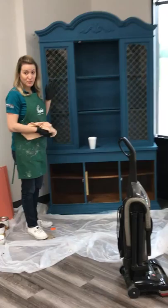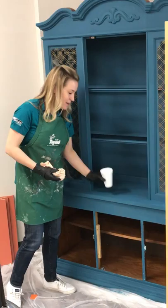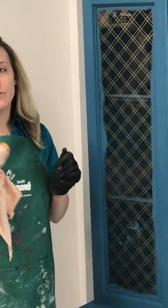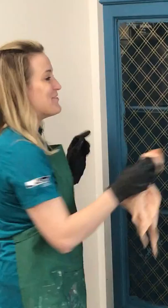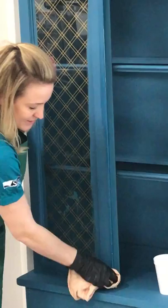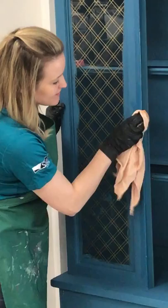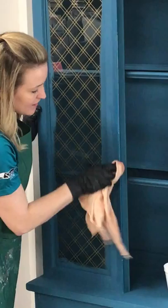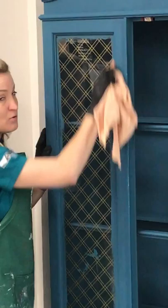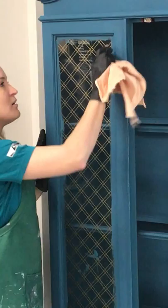Come with me. We're going to go across to the armoire that's already been coated twice. This is our lovely armoire that we painted. It was cream and coral on the inside. I've got a cup of water here and a nice clean rag. The trick to distressing is you want to hit the areas of the piece of furniture that would naturally distress. So I'm going to hit these areas on the insides of where the door used to be. You can see that cream color kind of showing through, and there's going to be some areas where wood grain actually shows through as well, because I sanded down a fair amount.